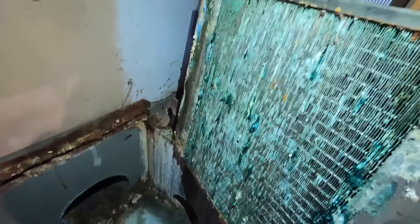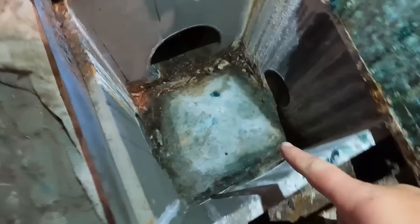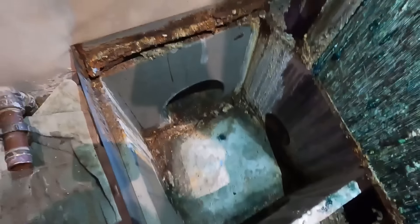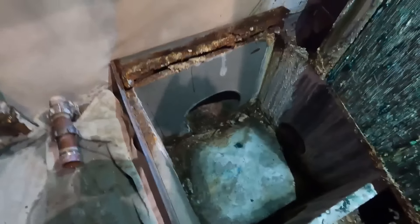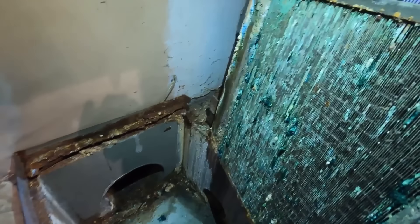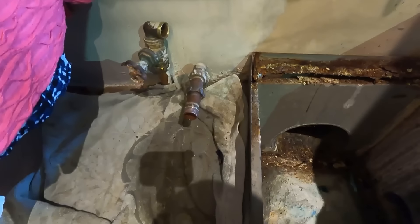There you go — there on the bottom, look. It's massively corroded. It's not one big hole, it's loads of little ones. It's just rusted the copper out. Obviously it pushes the warm air through there, that way, that way, that way, and that way. I like the way it's got that triangle in the middle to direct the air — otherwise it would just hit flat on the floor. So we'll get that all clean. I can rebuild that — it just sits on the top. Let's get this out and put a couple of caps on there while we reassess.